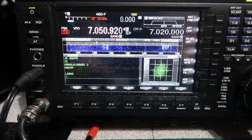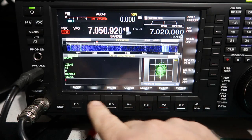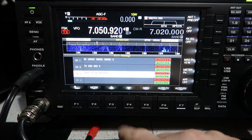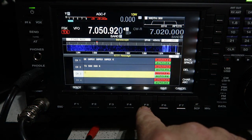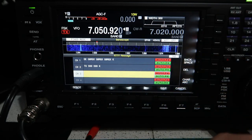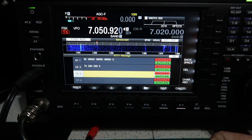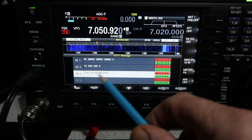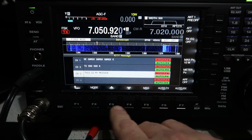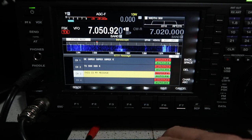The other thing to show is transmission in RTTY mode. If you look on the screen you'll see options at the bottom — 'Memory' is the one to look at. Memory is where you go to edit and store individual messages for transmission. I've only got two set up by default: a traditional 'from my call sign three times' and then a 'TU 599 K'. Using the up and down arrows you can select different messages, then click the message button to edit.